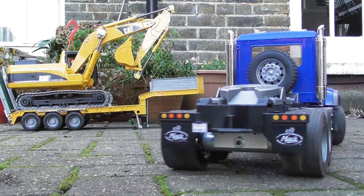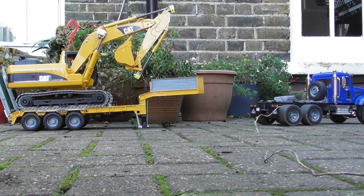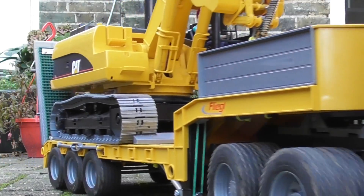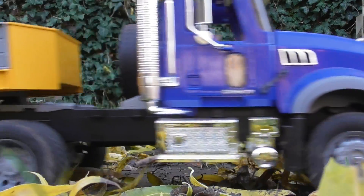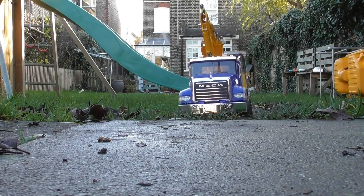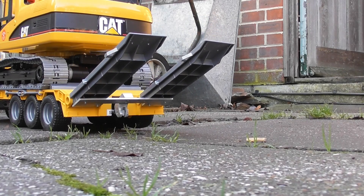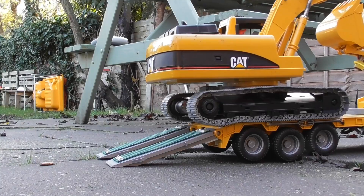In conclusion, Piggy Taylor's ramp lifting mechanism does exactly what it says on the tin - and it does it extremely well. There was certainly nothing that I could think of to improve or modify. The most important thing is to get that plate absolutely lined up - you don't want it too high or too low because it's either not going to work or it's going to fail on something. I think it's a very cleverly designed product made to an extremely high standard - no finishing required afterwards, just eight holes to be drilled in the right place and you're away. His choice of motor and gearbox is good because it gives a nice scale speed. For the price you really can't complain and it really would not have been worth my while trying to fabricate something to do exactly the same job. This saved me a lot of time and I'm certainly not one to go reinventing the wheel for its own sake.